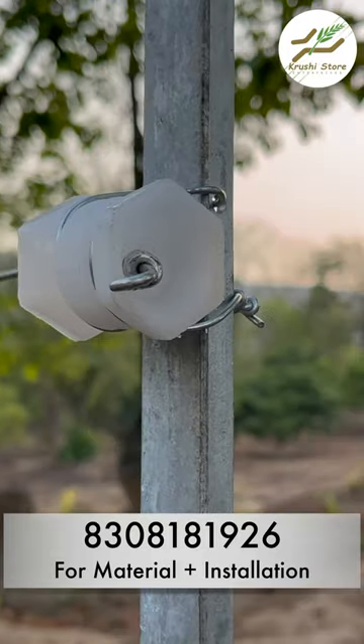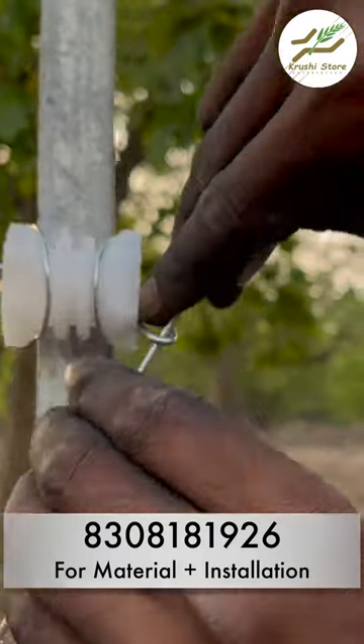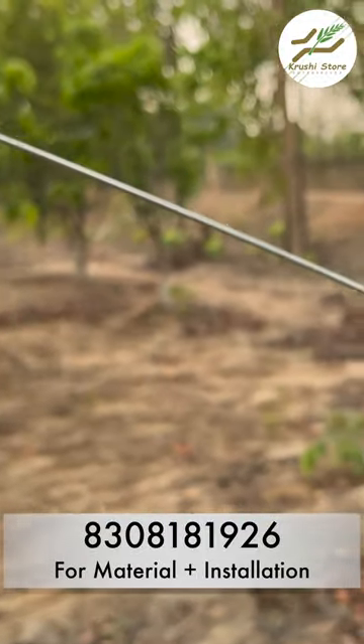We will cut the wire at this end and leave it, which will get stuck in the nearest reel insulator. Then we will take the new wire that we want to attach and make the same thing — we will make a circle and tie a knot around it.